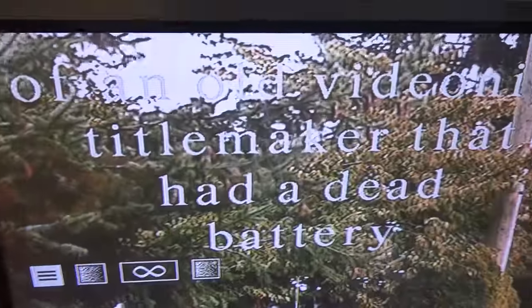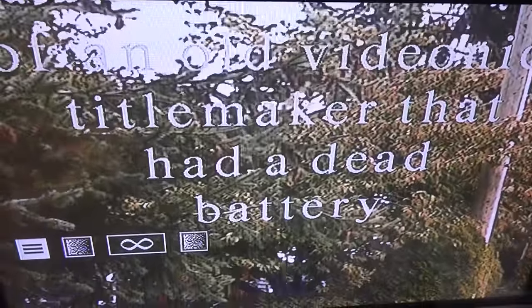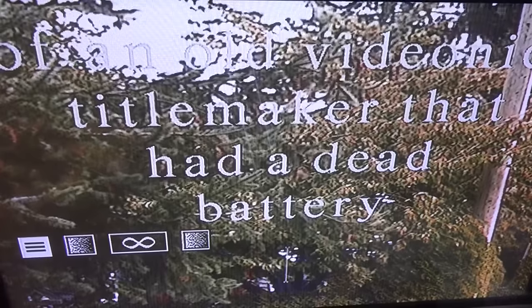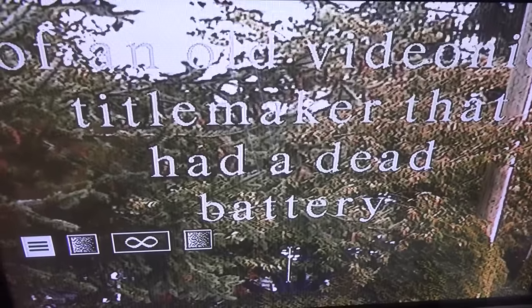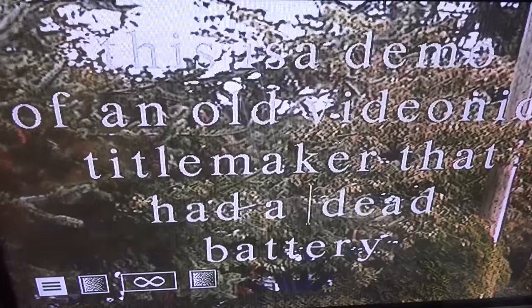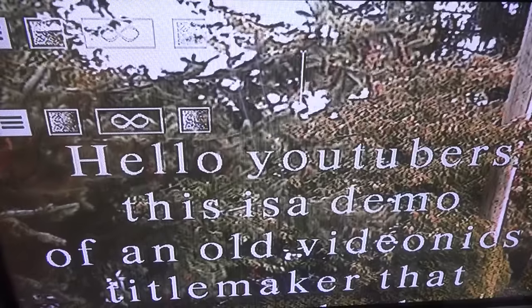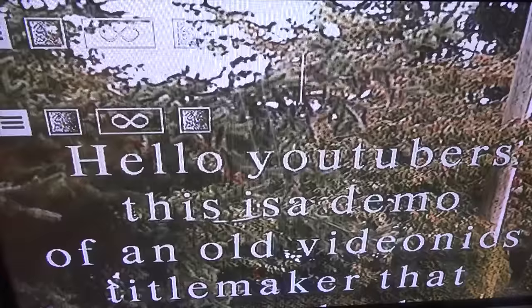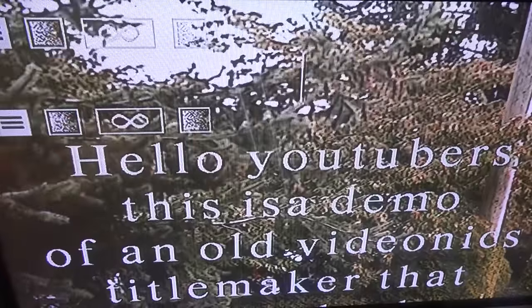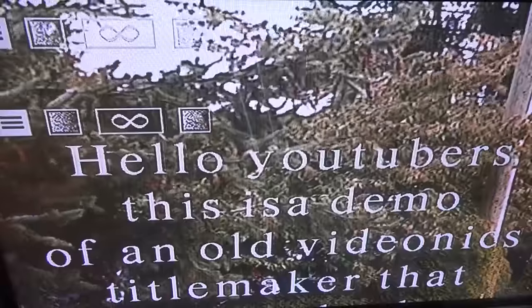What I've done is I've now created, and this was the beauty of the TM2000, because this is the information that would come up on the preview monitor. But the video would be being fed through until you actually went live. So in this case, if you were going to fade up on that and you wanted to have your title fade up, you'd go into your blank page, which was just a transparent video, and you'd hit play.